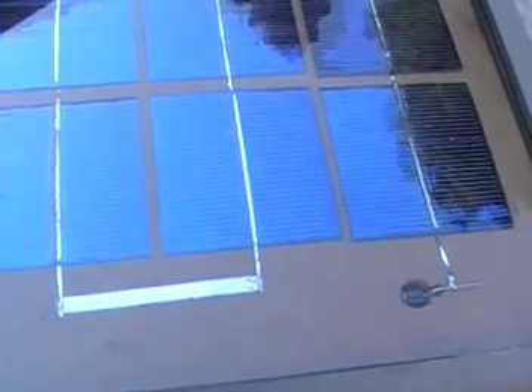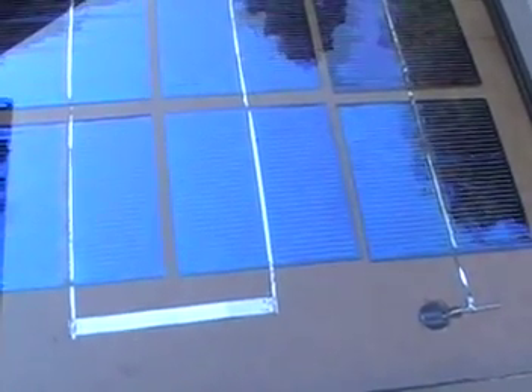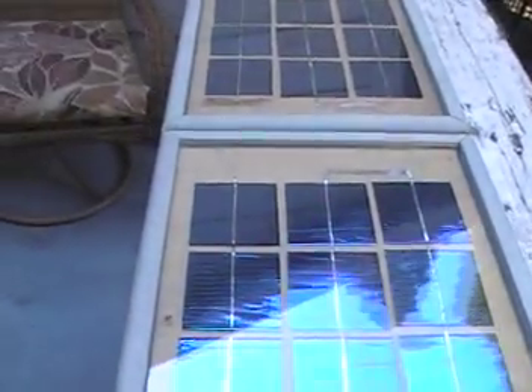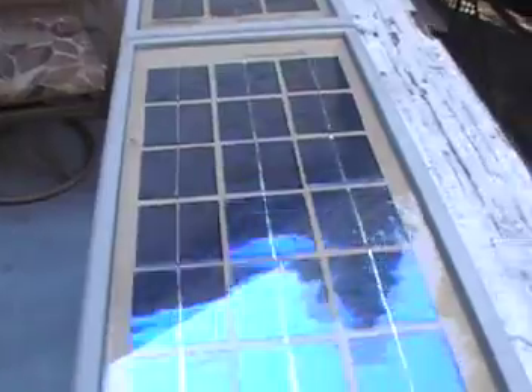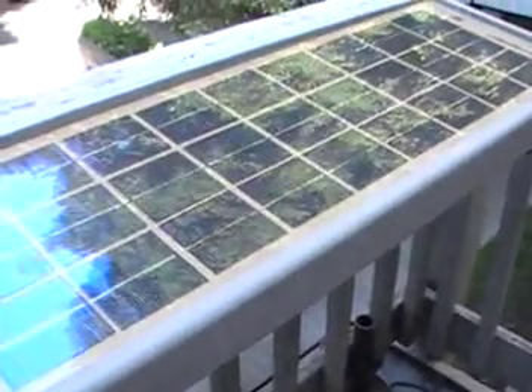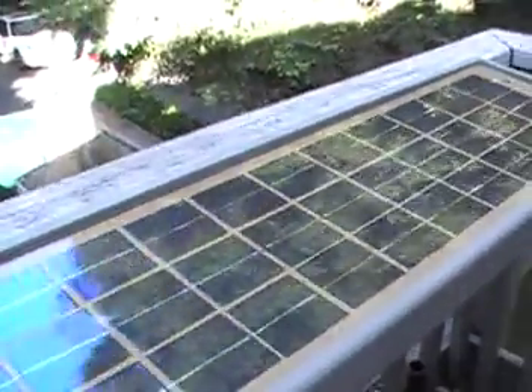You can see from here that if you follow the right side up, it goes all the way up to the top, comes over, comes down the middle section, meets this side, and then goes back up to the top. These are all in line — or you would call it in series. This solar panel would make up 18 volts at 1.7 amps.